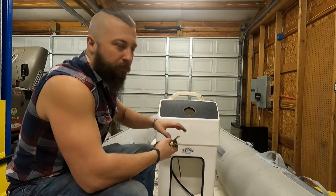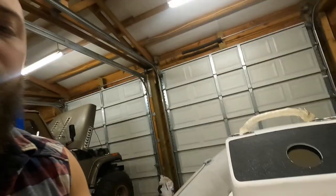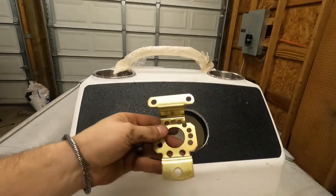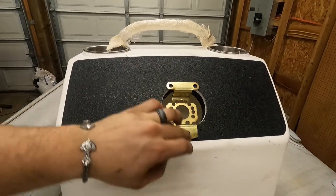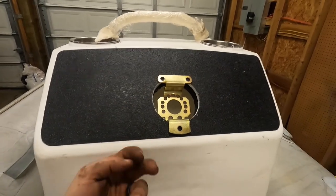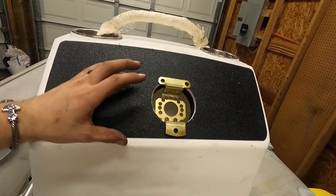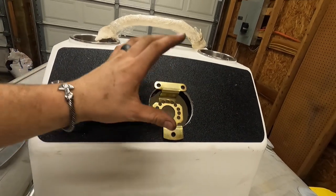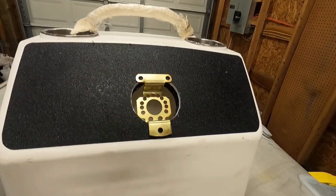I punched a big hole in here — this is the mount bracket. I set that in there and it takes three bolts. Then the steering box — where the cable goes in with the shaft — everything comes through there. You pull it to here and there's a nice plastic cover that goes over and hides it. I'm going to get ready to drill it.